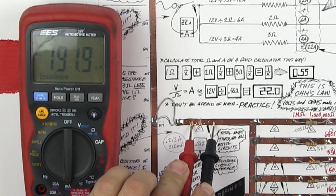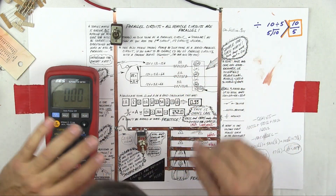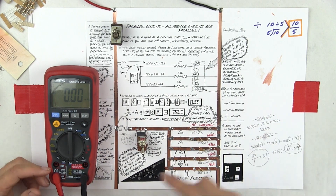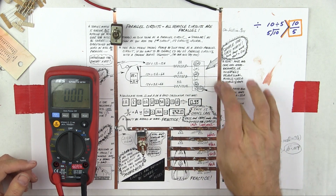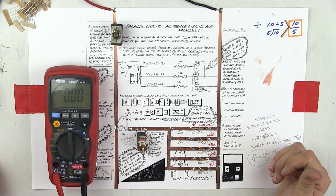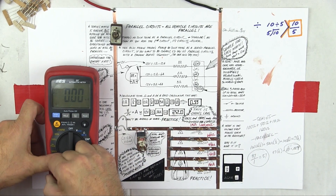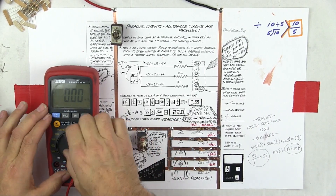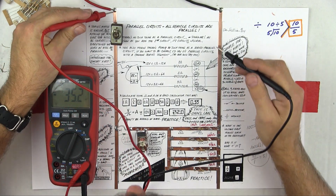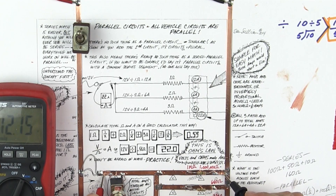If you're a student, play around, ask questions, build circuits, have a good time. If you work every day, don't be afraid — put the fuse in, if it blows it blows. I'm going to read voltage now to see what my real voltage is, because with the circuit under load the terminal voltage may have dropped. Here I'm at 12.17, and here I'm at about 12.15.